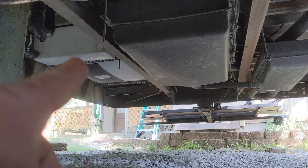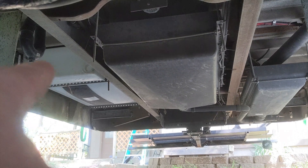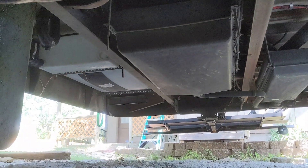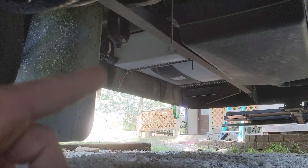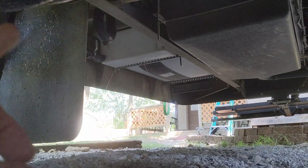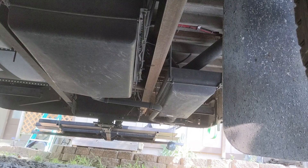Fresh water tank with a heater, because I'm in Missouri and it freezes — so that keeps everything from freezing. Over here you can see I wrapped all my pipes. I got heat tape on them; it runs off solar and when it gets below 40 degrees it comes on and keeps all the pipes at 40 degrees. Gray water tank. Black water tank, which is way too small.